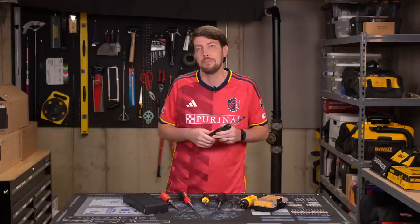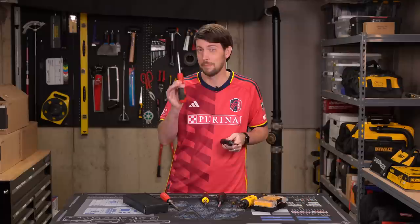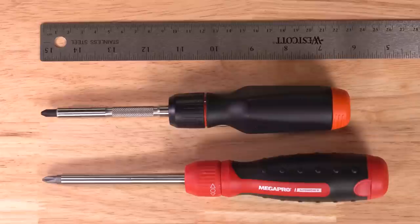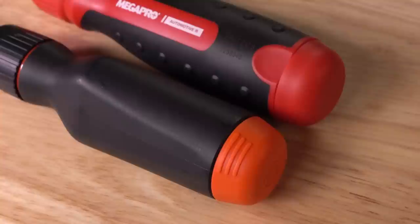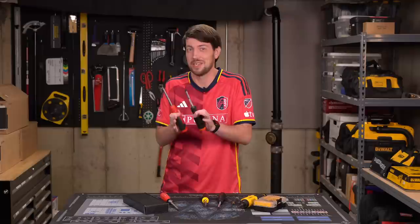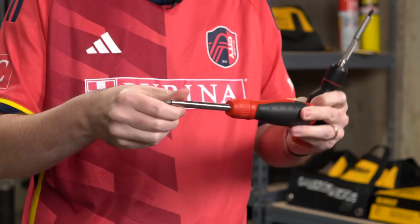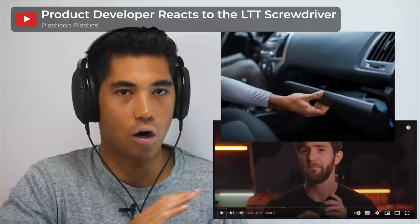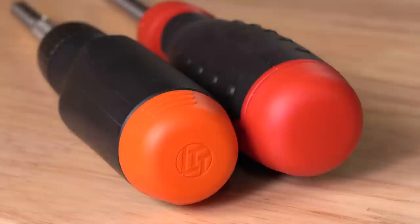The most frequent question after my first review was: how does the LTT screwdriver compare to its progenitor, the Megapro Automotive? A lot of people still say the LTT screwdriver is just a rebadged Megapro — that is far from the truth. The Megapro is more than two centimeters longer, the shaft has no knurling and it's a straight blade like the PB Swiss, the bit holder opens with a different detent, the end cap is rounded instead of flat, and the grip is overmolded with rubber for much more grip. The ratchet mechanism is opposite the LTT driver, and the sound and feel are a lot different. There was a great video by Plastic and Plastics that went through a lot of the manufacturing details. This screwdriver has a few parts inherited from Megapro, but it's not even close to being a white label rebadge where LTT just stamped their logo on it.